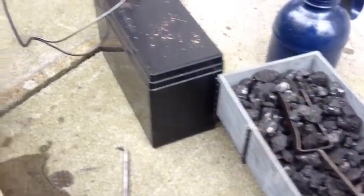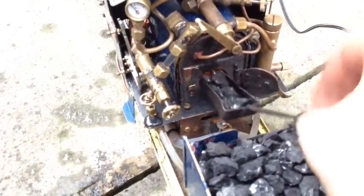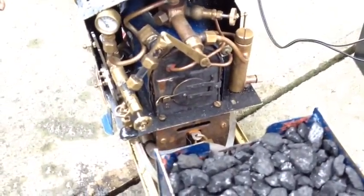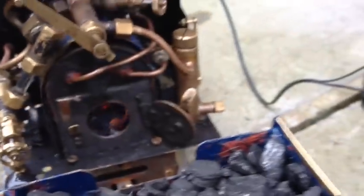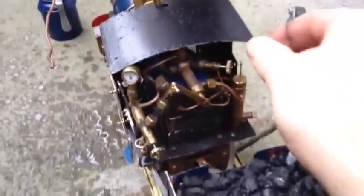That's about half a shovel of coal. The trick with this is to let the first shovel full of coal catch — you need to wait before adding the next shovel full, just until it's lit. The pressure gauge is starting to rise now. Nice fire. Really should try and keep the door shut as much as possible. The fire's caught nicely.